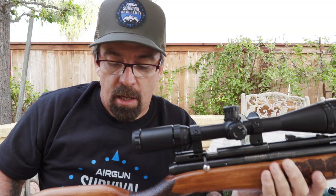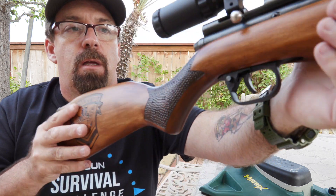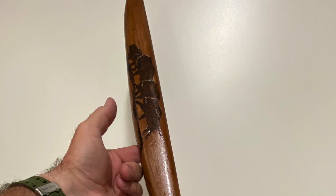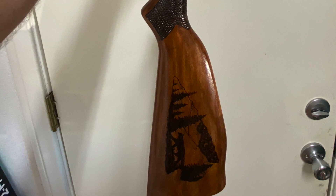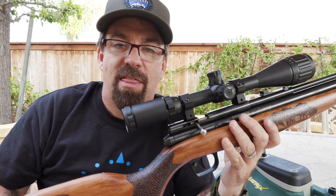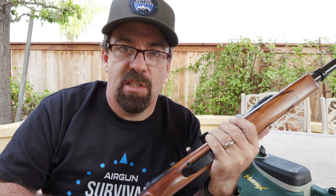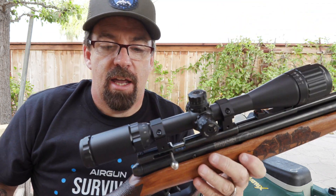Let's talk about staining. I used an early American type — I think it was Minwax stain — and I gave it two coats. You can use anything out there: there's Polyshades, there's all sorts of stuff you can use, and that's the cool thing about art. Whatever you do, that's your mojo, that's part of you. After the stain dried, I lightly buffed it again with some 4-0 steel wool, and then I took a rag with just a little bit of isopropyl alcohol on it, cleaned it all off, and then I lacquered it.